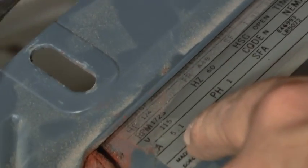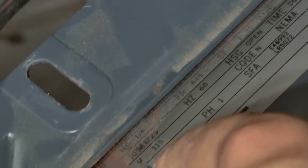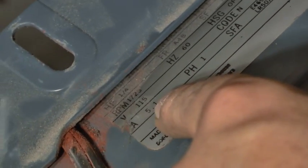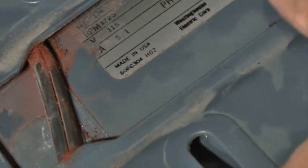It's a quarter-horse motor and I write all that down. If I get my belt too tight, or if my pulleys were the wrong size, I tend to run at a higher amperage which will wear out my motor — it won't run efficient and it won't last very long. So when I put this back in, I'm going to check my amperage and make sure that I'm at 5.1 or real close to 5.1 amps.